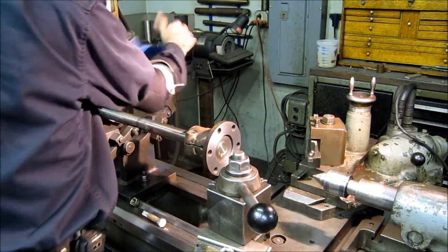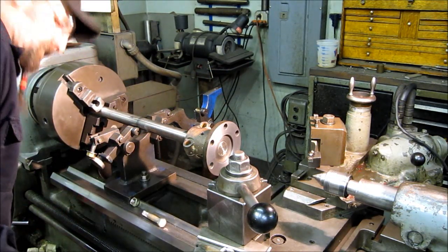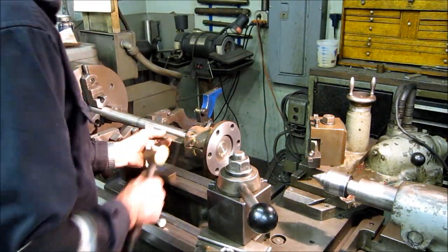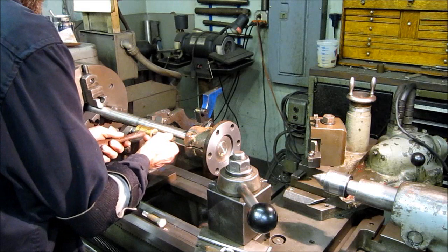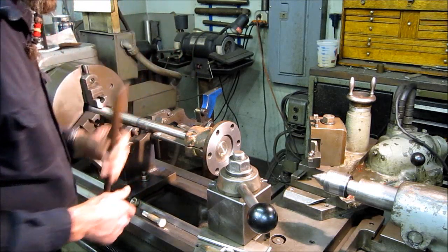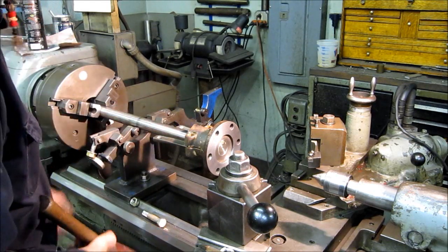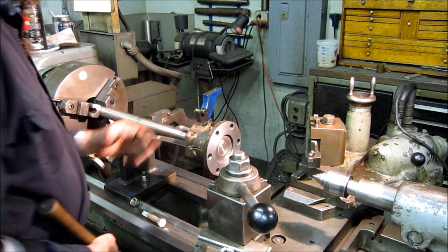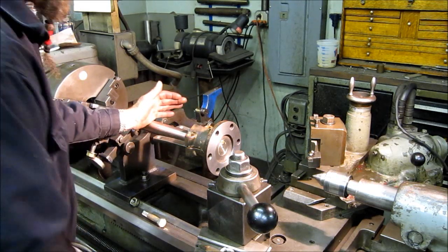Alright, get a little more room here. Same thing. I have the luxury of standing here and doing it and not being crowded. Same thing, but it's coming off the shaft, even in the bilge. And I know your space is in here, okay? Here's my steady wrist, you know? That's as much as you need to tap wedges in, okay? The boss over the key kind of gives you a little bit more height here if you have to hit it. If you have to do more than an average tap off of here, slide your hammer.